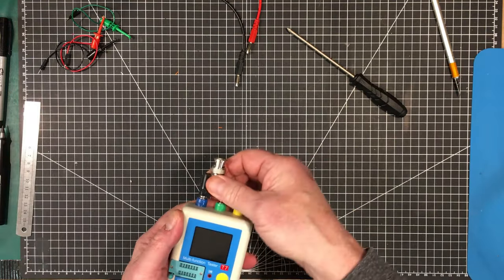That should be like a 1 ohm resistor. These are kind of long leads for a 1 ohm resistor, so if we see something around the 2-3 ohm range we should be okay with that. 0.97 — that's pretty good, I'm happy with that. Let's try 100 ohms: 101.2. That's good. Up here at 10k ohms: 10.4k. Let's see if it'll handle 10 megaohms: 10.17 megaohms — beautiful. This is far more professional than dealing with those tiny original connectors.